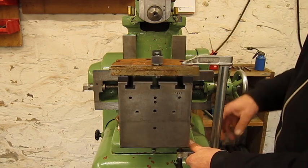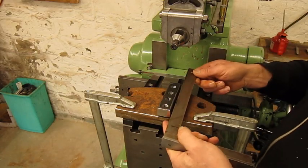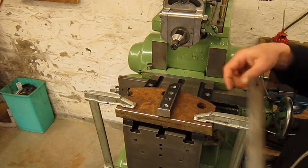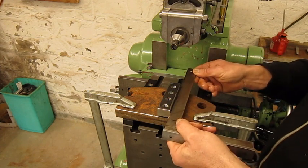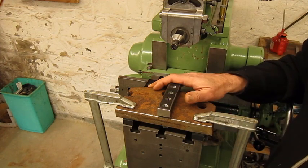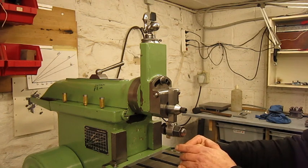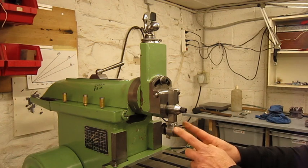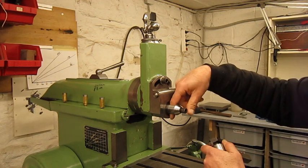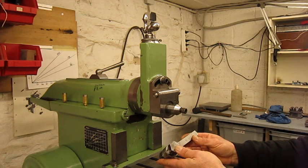Take a scale — or I took my square — and try to line up with the T-slots you see in the bottom. It's very easy. Now I'm gonna take this part off again and let's talk tool holding. Sometimes there is the question: shall I use this extended tool holder or shall I put the cutting tool directly in the tool holder? Let me show you the why and the why not.